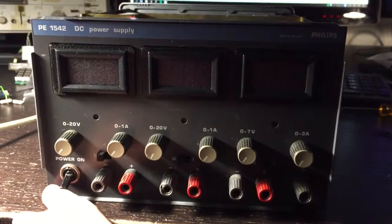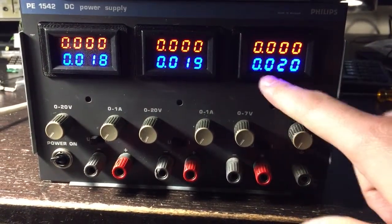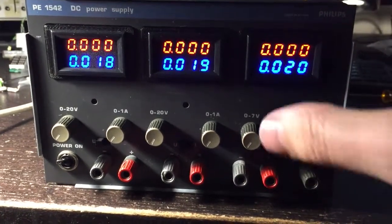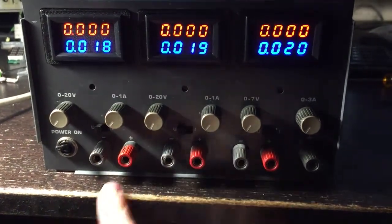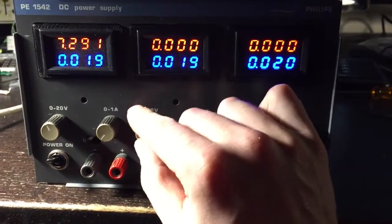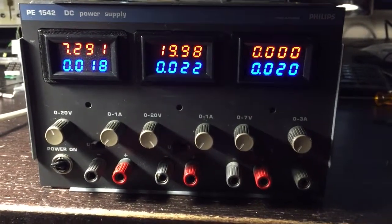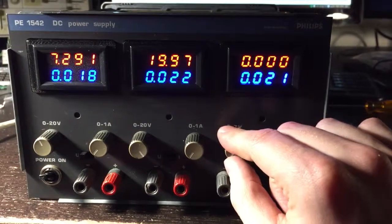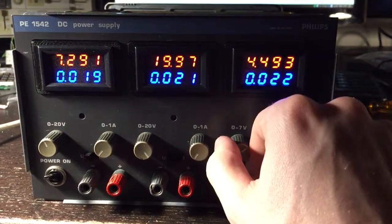It's basically fully put back together — just need to put the shell back on. Pretty good. I don't know why these currents are popping up here; I have a feeling some current is flowing through the circuit just to keep it running because these potentiometers were tied to ground when I was breaking the contact. But yeah, it works. It's not super responsive but the meters were ridiculously cheap so the sampling frequency isn't something magical, but it does the job.